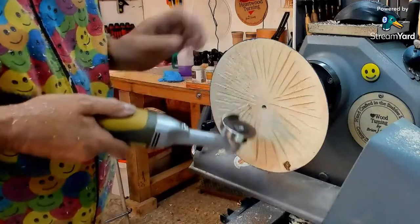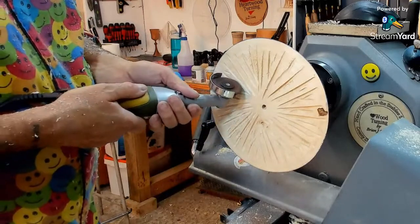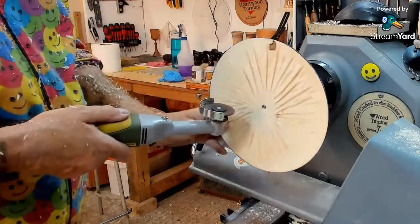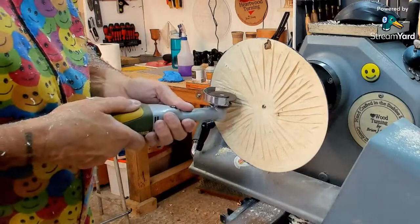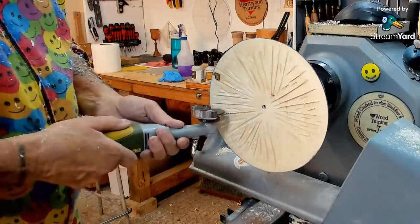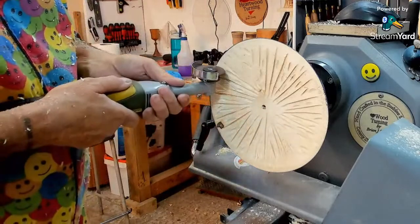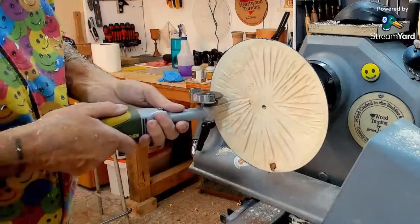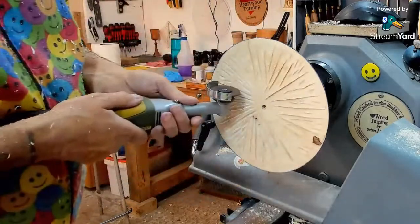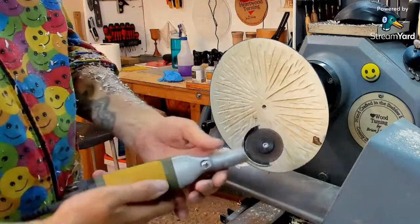But you have to be careful when you first use it, Paul, to gauge how quick it grabs you. Hold it really tight for the first go until you get used to it. Try it on a sacrificial piece first, just to see the actual speed it bites in. Then once you get the feel of it, you know how to use it. Like a buffing wheel, isn't it? You put it on a buffing wheel at 1,000 revs, and all of a sudden the wheel just rips it out of your hand across the floor. And keep your fingers away from the vents where you can see the silver bit meets the vents here. Look, I'm holding it on the neck. That's what cools it. The vents are free.